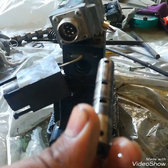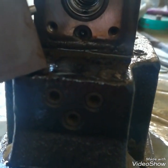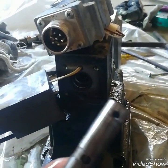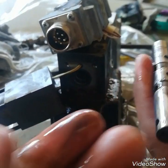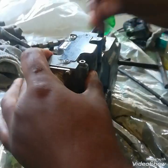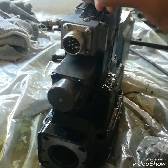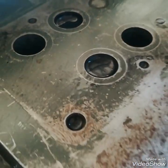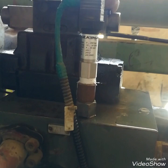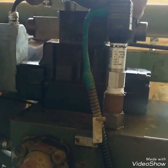When the coil operates, the supply of oil changes and the jack moves forward or reverse. It also needs cleaning — I will clean it with diesel. After cleaning, I fixed it back. I have also cleaned the block. Now I am installing the DC proportional valve back to its position.